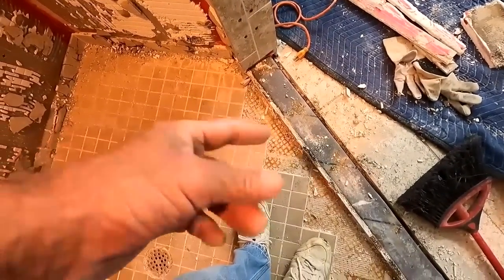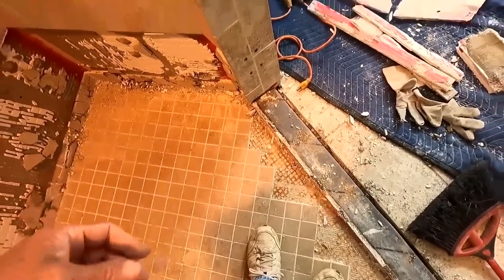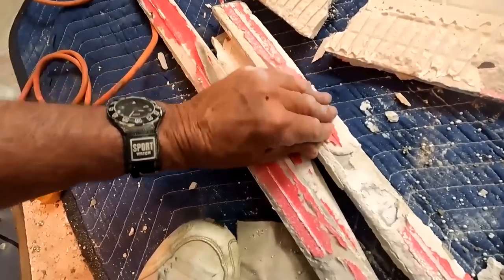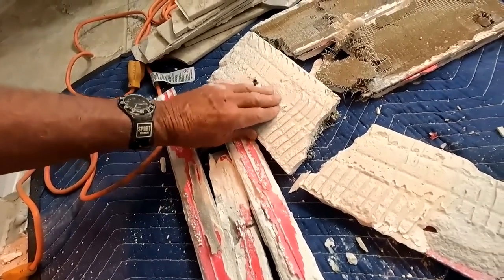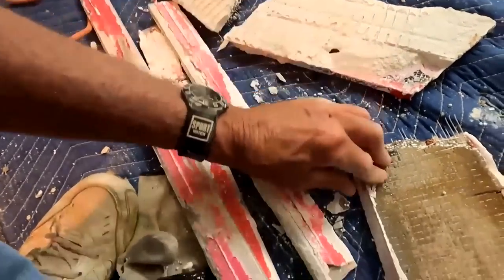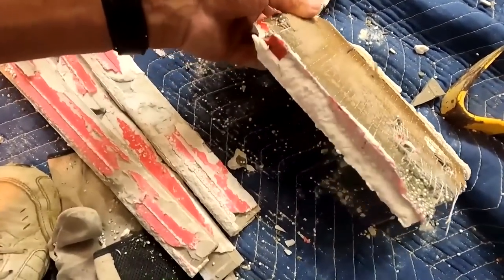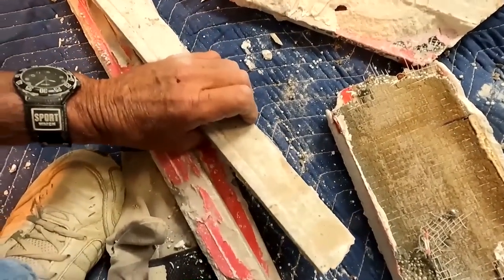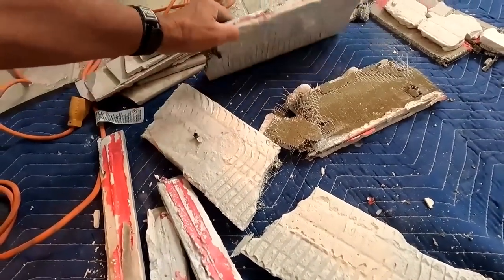But my take on it is this is not the failure, even though there was some moisture and there was still, years later, some wet caulking. I thought it was thinset, and it might be thinset, because some of that pre-mixed thinset will never dry out properly. When I took a piece out, it was clearly still wet. And even though these guys just moved in, they never used the shower because they knew from day one it was leaking, so they stopped using it. I don't know where that piece is now.